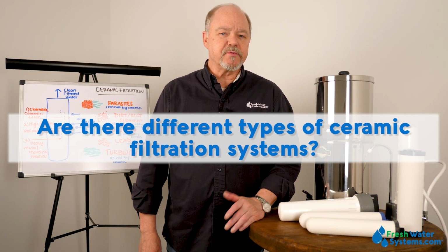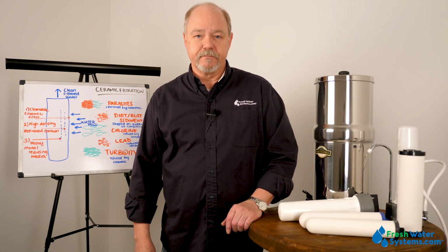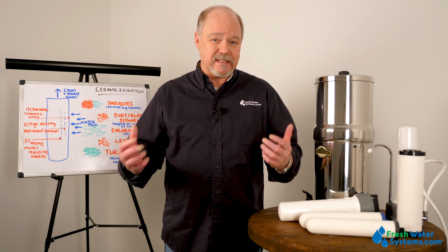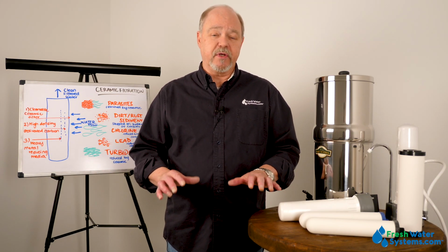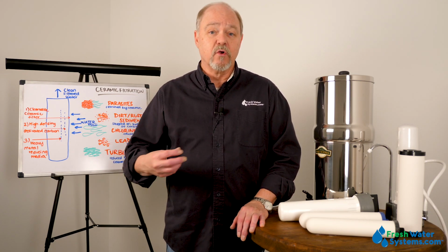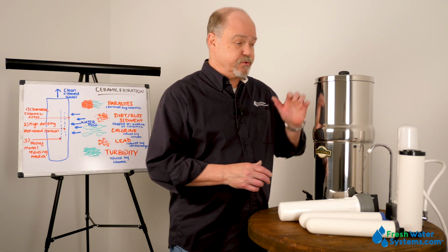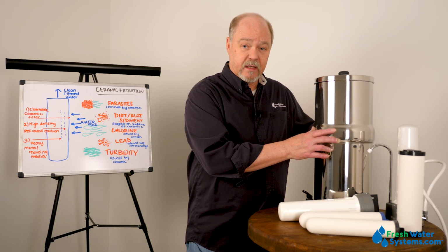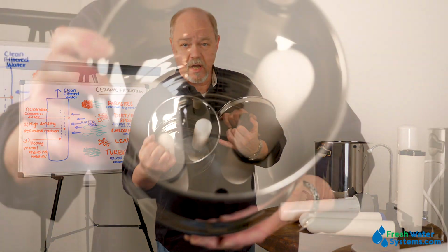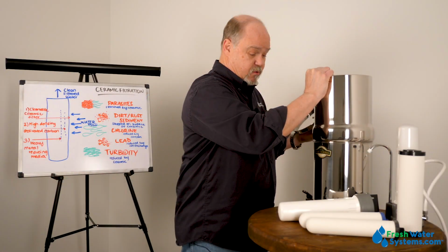Are there different types of ceramic filtration systems, and if so, what do they do differently? Well, ceramic filtration systems do come in a variety of shapes and sizes. Most of the application is for point of use, or places where we're going to actually consume the water right away. The most usual use for ceramic filters is in a gravity-fed system. And this system works purely by having a reservoir with a couple of ceramic filters inside, and it sits on top of this bigger reservoir.